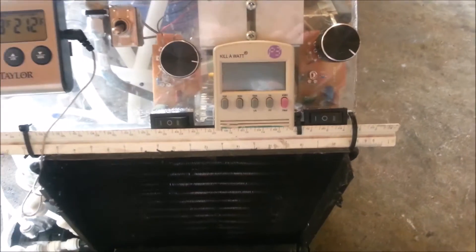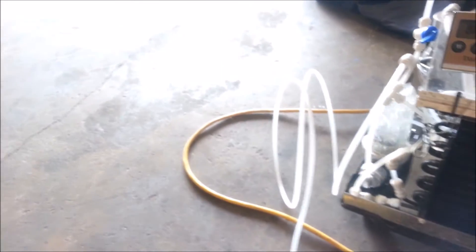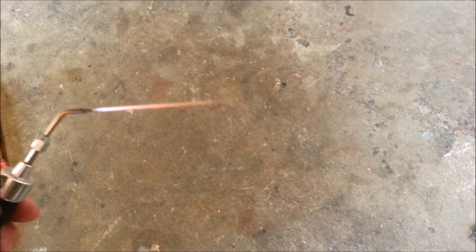That's at about 15 amps right there. I keep track in amperage because I know at about 15 amps I'm going to blow my power — that's 1,600 watts. It's on the verge of a turbo flame but not quite there yet. Normally this would be about 16 inches long with the number 5 tip. Definitely reduced the length and fanned it out some.